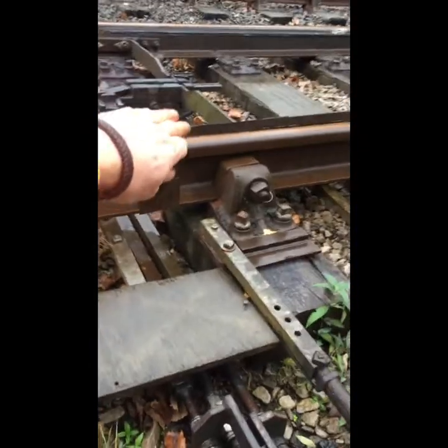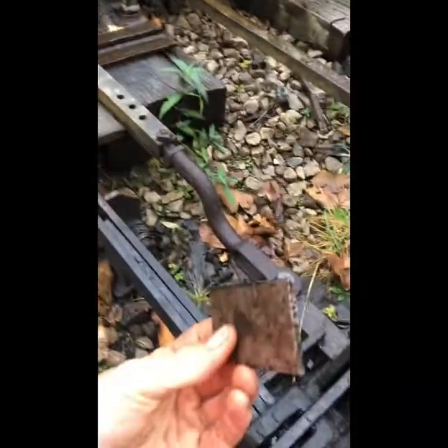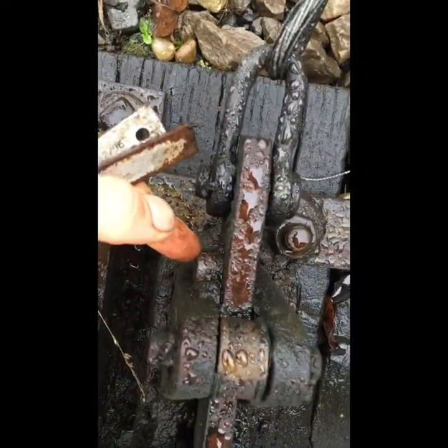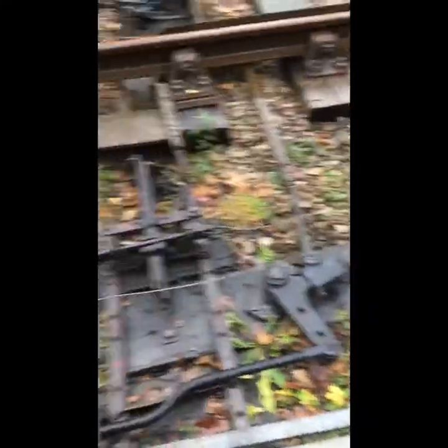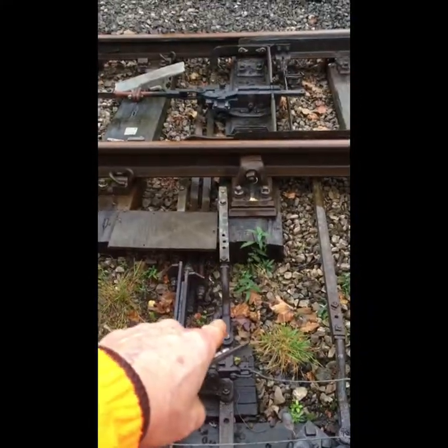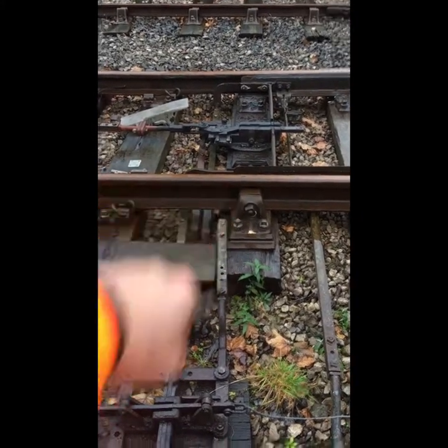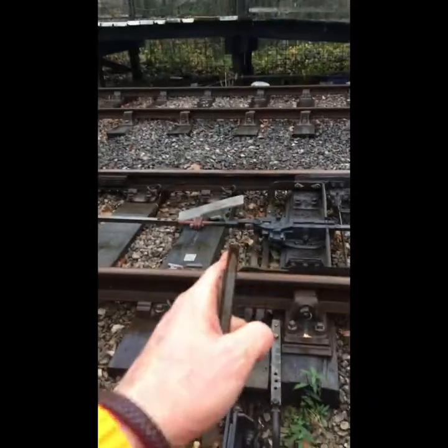You can put that between the switch rail, close it up, and check your detector — but I'm not moving the points here today, so I'm just using this to show you how we do it. One important thing: your detector should always go back onto this stop here, this stud. If it doesn't, the notch in here will foul these blades and you won't be able to put the points over. Tie your detector to your front sole plate or stock rail so that it moves with expansion and contraction, as do your points.